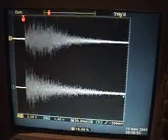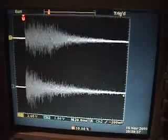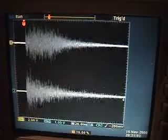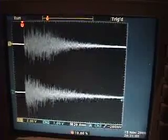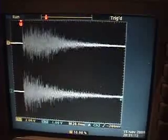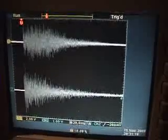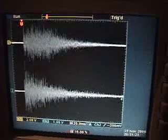On the bottom trace, what I have is the LM1's hi-hat sample output. The way the LM1 works is it triggers the hi-hat over a continuous running output of the EEPROM. What that means is every time the trigger comes in, it applies the hi-hat envelope to the output of the EEPROM and plays that, so what you get is a variable output of the hi-hat. This may be one of the reasons why the LM1 has a different kind of groove as far as a drum machine goes.